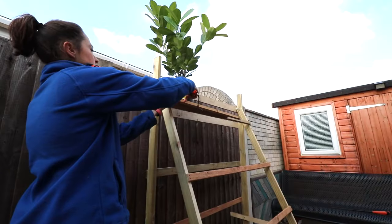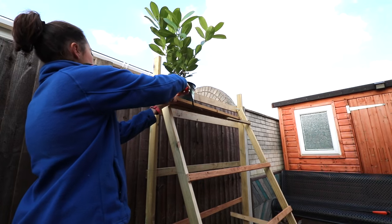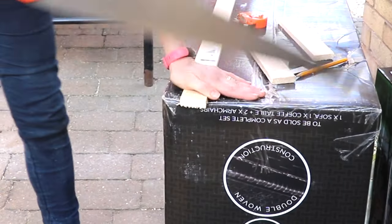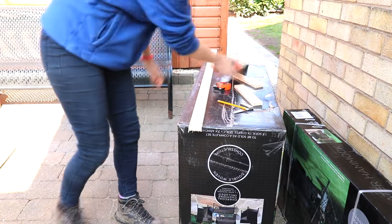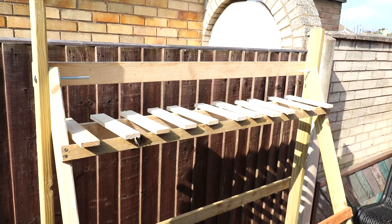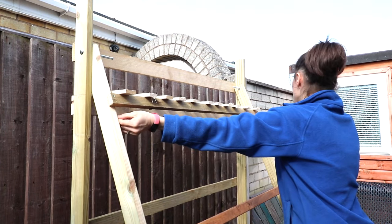For the cladding I held two pieces of wood together that will be part of the shelf's cladded frame at the front and the back, so I could work out the length of my cladding pieces, but I added about half an inch so it wouldn't be too tight a fit. My slats are running front to back. If you wanted you could have them running the other way and add some supports on the frame itself, but the reason I chose this is because I could use a lot more offcuts and the shorter they are the less likely to bow.